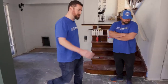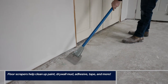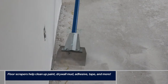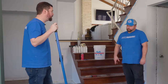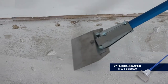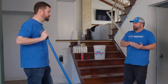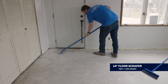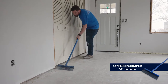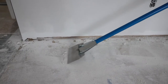We had some drywall mud and paint in this room from earlier work, so the first thing we did was take a razor scraper and go through scraping up all the big chunks and clumps of paint. The blade is pretty flexible, which helps absorb shock on your hands. We also used a longer one — about a 24-inch blade — that made quick work of the whole room, and the smaller one for tighter spaces.